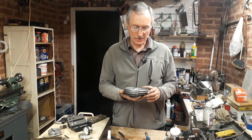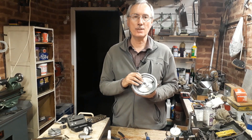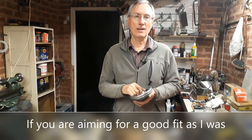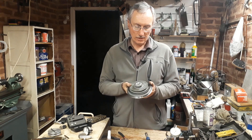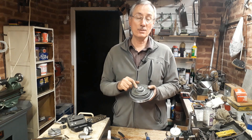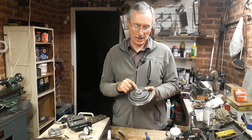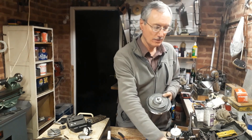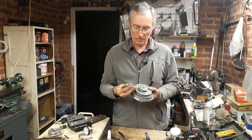Things have not worked out as I expected. The first big lesson is: make it out of a solid piece of aluminium — don't try to push aluminium against aluminium; it cold welds together and can be very awkward. Lesson number two is: if you've produced an assembly drawing, make sure you have it with you. I tried to do this without the assembly drawing and I bored this smaller bore too far, which basically cut off the flange of the smaller pulley. That's a big mistake on my part, and I will be remaking this part.